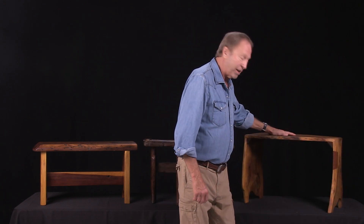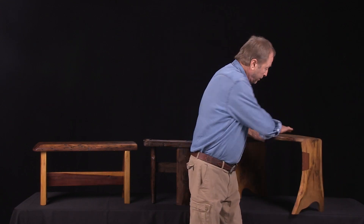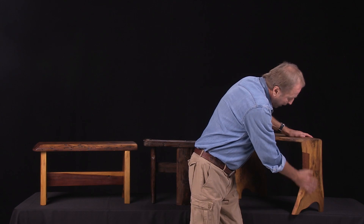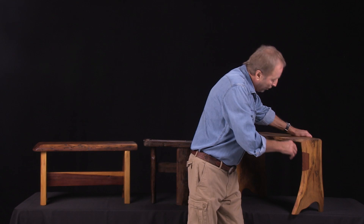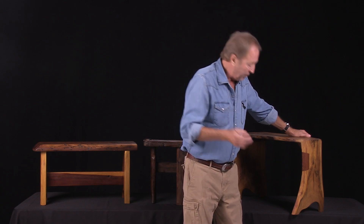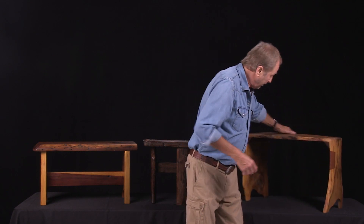It's English chestnut. It was all warped but it had some really nice shape. It's all called a waterfall edge because it was all one straight piece and I mitered the corners so that I could drop it down. The grain pattern is beautiful but it was so wavy and bent, and then someone had made a bad saw cut here. So instead of trying to patch it in an exact machine-shop sort of way, I had some nice African lacewood and I did a nice angular inlay in there and that came out nice.